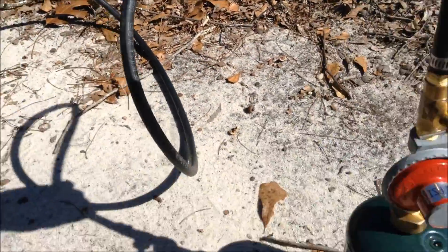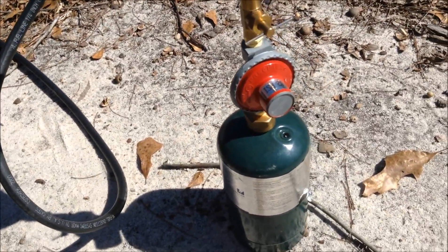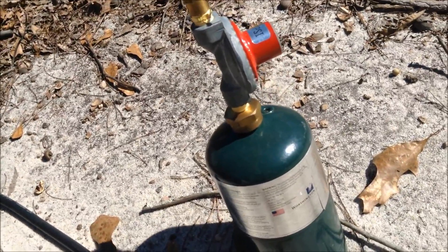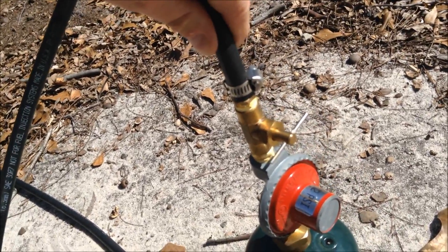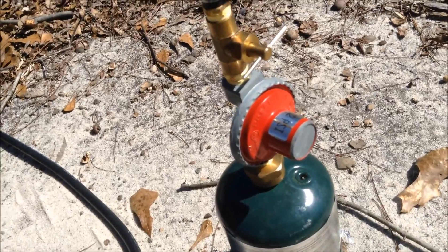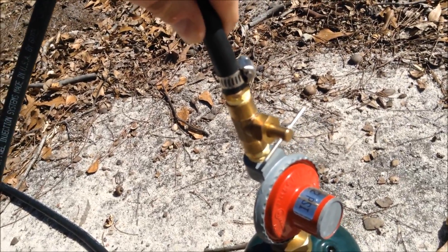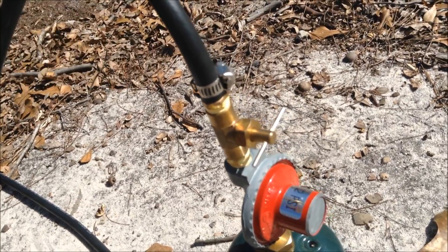I have my original setup to run on a 20 pound or 100 pound propane tank for emergency purposes. But this is an adapter for a throwaway bottle, and as you see, I have my regulator and I have my control valve there. The regulator regulates pressure, but your needle valve regulates flow — that's what's also going to set the RPMs of the engine.